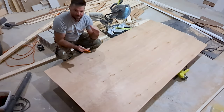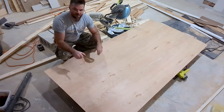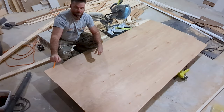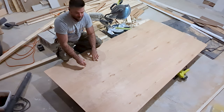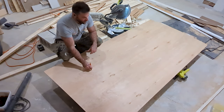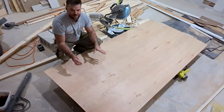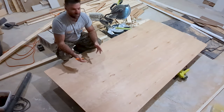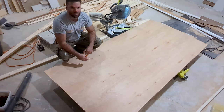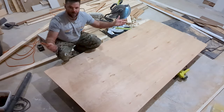The higher side is going to have an extra little panel with a light so that when we're watching a movie, the main panel lights can turn off and the bottom ones can dim, so you have that nice courtesy lighting along the floor that won't dilute the picture at all. The first thing I have to do is cut all the panels to 36 by 80 and build them into little boxes mounted to the wall — that way if we move or need to access wires, it's just four lag bolts off, access the wall, four lag bolts back on, and we're back in the Death Star.